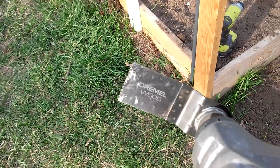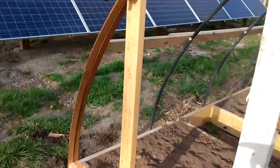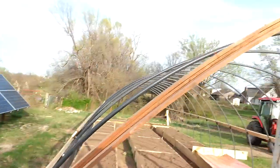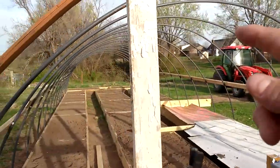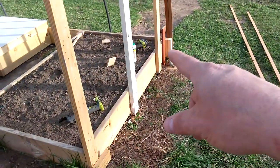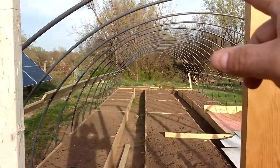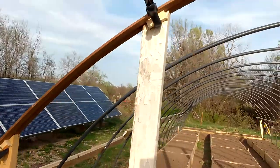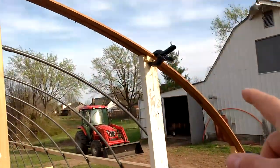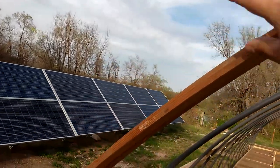This is one of the best tools you can have for outdoor cutting work — a reciprocating saw will work as well. Once that first end piece is glued and has a couple screws in it, I'll take it off this end of the greenhouse, walk down to the other end, and screw the starter boards to the far end four-by-six boxes. That'll be my starter hoop on that end. Once that's done, I'll add the uprights, plumbing and gluing them at the top.